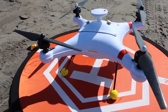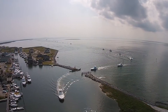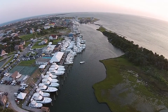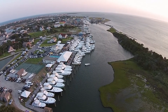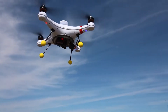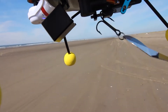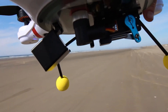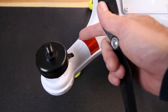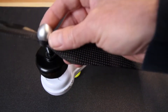Here's a bird's-eye view of the release mechanism and pin system. All it is is a servo with an aluminum arm and a little pin that runs through this U-hook. You can get a pretty large hook up inside there — it's about a half inch. It will carry up to 2.6 pounds of payload. It's pretty industrial — it can lift just about any size sinker. Some of the biggest sinkers people use are around 12 ounces, and it will absolutely carry a 12-ounce sinker.